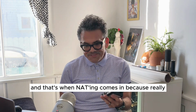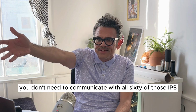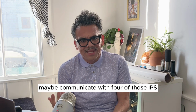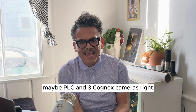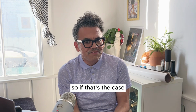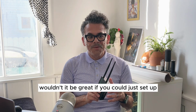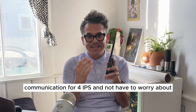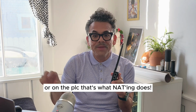Because really, if you think about it, you don't need to communicate with all 6 of those IPs. You really only need to maybe communicate with 4 of those IPs, maybe a PLC and 3 Cognex cameras, right? So if that's the case, wouldn't it be great if you could just set up communication for 4 IPs and not have to worry about changing anything on the machine or on the PLC?